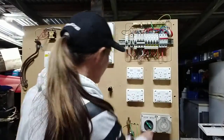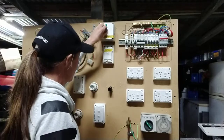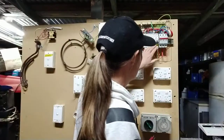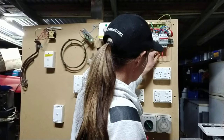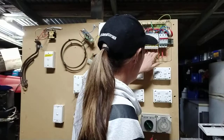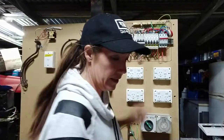Make sure all your switches are on — hot water on, oven on, thermostat on, everything is on. So what are we actually trying to do? We're trying to check our neutrals and make sure any neutrals are not interconnected. These neutrals are switched, so I can technically test from the load side of each neutral and each active on whatever's switched.